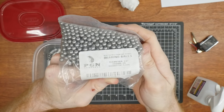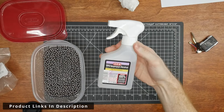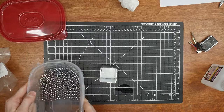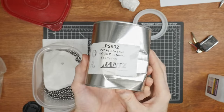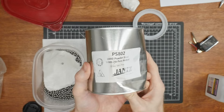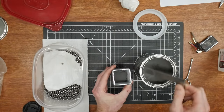To fill my can I'm using some quarter inch and eighth of an inch 52100 ball bearings that I found online. For good measure I clean them with rubbing alcohol to remove any contaminants. The steel powder I'll be using is 1080 with a 2% nickel content from Jantz. The 2% nickel will give more contrast from the ball bearings, kind of like 15N20 does on normal Damascus billets.